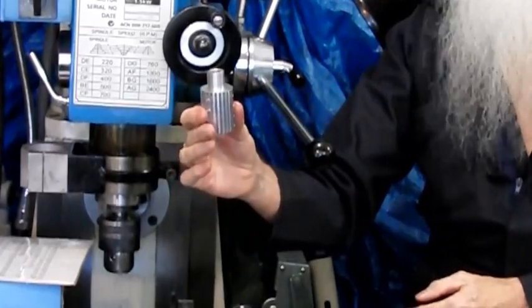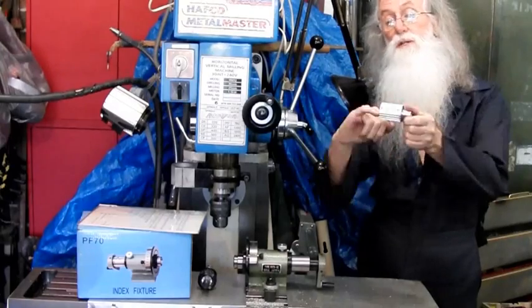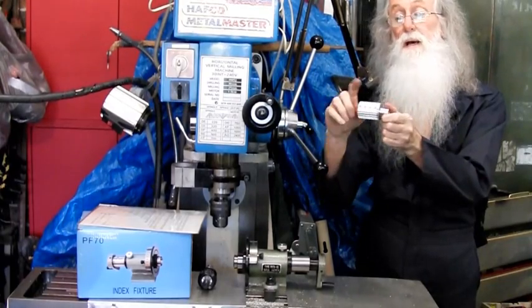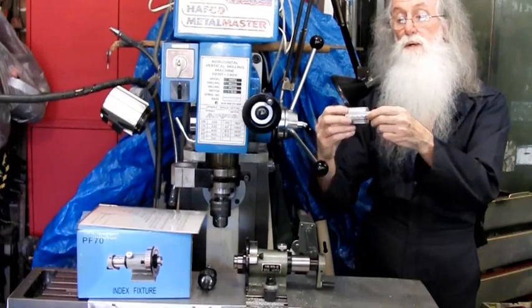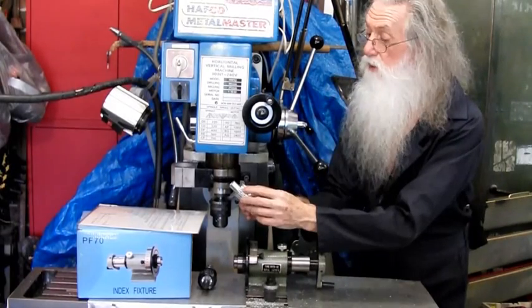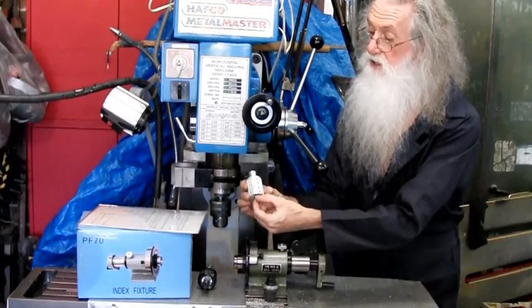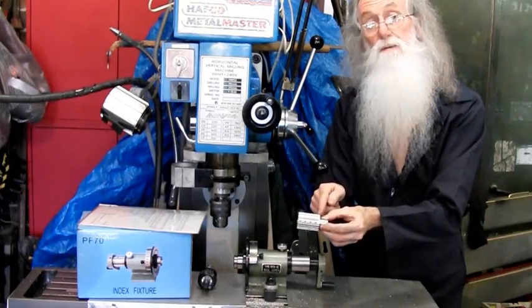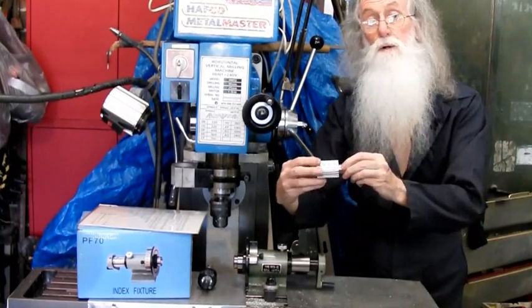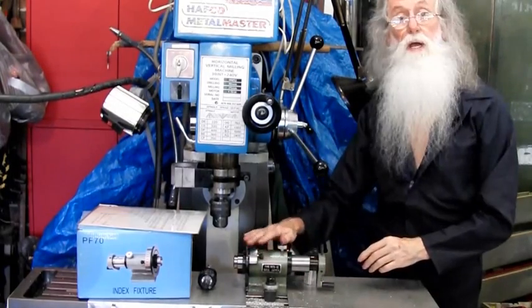That's how much I've left on. I finished at the size and the bore. When it was in there, I then checked the bore with the dial indicator. I think it was 2 thou out, so I just tapped it 1 thou down one side, and it was running true, tighten it up. That's where the run out is. I added 5mm there. I've left a mil to take off that face, so those dimensions I've added the mil. I'll put this back in the lathe, face down that face, and part off whilst holding on there. And there's the stacked 30 tooth XL pulley using the highly recommended spin jig.